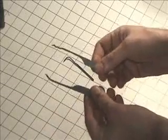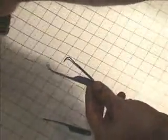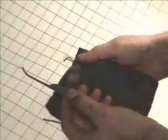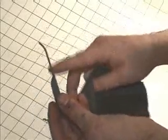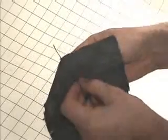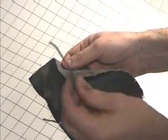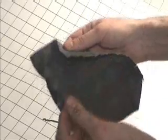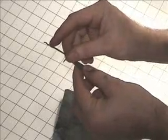The last step that's very important to making a good functional pick set is to sand them down. Simply get some emery paper. You might want to start with a coarse grit and then work down a little finer, but you want to get the paint off. That paint should be taken off to give you nice smooth steel underneath your picks. So this is the part where you deburr, take off all the little edges and burrs, and you'll have a nice smooth, well-functioning pick. A little round file is helpful in some of these rakes when you want to get the inside out.